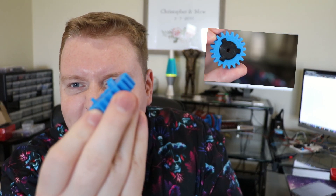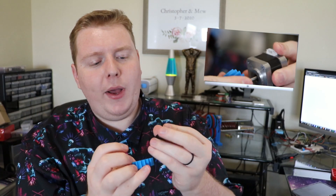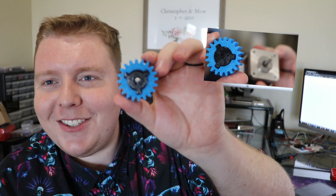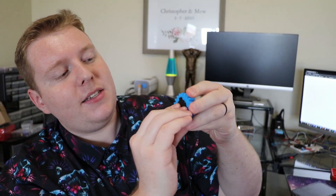Speaking of gears, all of the gears have been redesigned and they now have a very specific profile cut out of them, because we need to be able to fit this part right here. This part is cool — this is one of the old gears, just by the way, which has male ends that don't exist anymore. Because male ends go down and it would be facing this way — this is anatomically incorrect because technically the hole would be on the other side — but this part fits into the gear, and it can convert any of the drive shaft gears to a gear that goes on the generator. These need to be able to fit bearings, which need an 8mm hole on the inside, but the stepper motor has a specific shaft shape, so the stepper motor shaft profile can slide right into this one. This effectively saves half of all the plastic you would have otherwise spent printing gears, because now you can just convert any gear when you need it to fit a stepper motor.